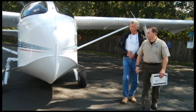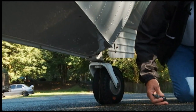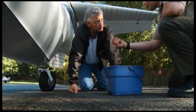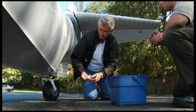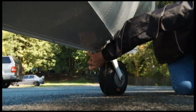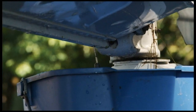With flying boats, be sure to check and drain the hull to eliminate any standing water. The drain plugs are located at the back — loosen the plug just enough so we don't lose any water with the tool, then as soon as you can finger-tighten it, pull the tool out of the way, slide the bucket under, and don't lose any of the water. Most flying boats have drain plugs built into the keel. When we come out of the water, we can take these out.